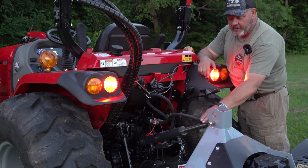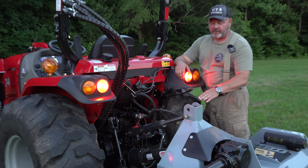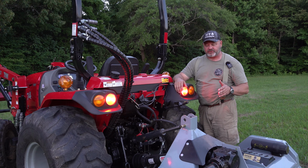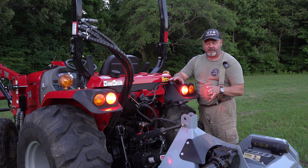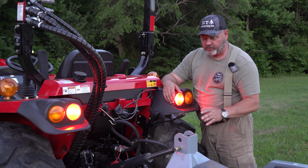So having the telescopic arm ends is a great thing. I also run a hydraulic top link, and I truly recommend a hydraulic top link for every tractor if you have rear remotes. It is awesome, very low expense compared to so much that you have on your tractors, and it makes the tractor so versatile.